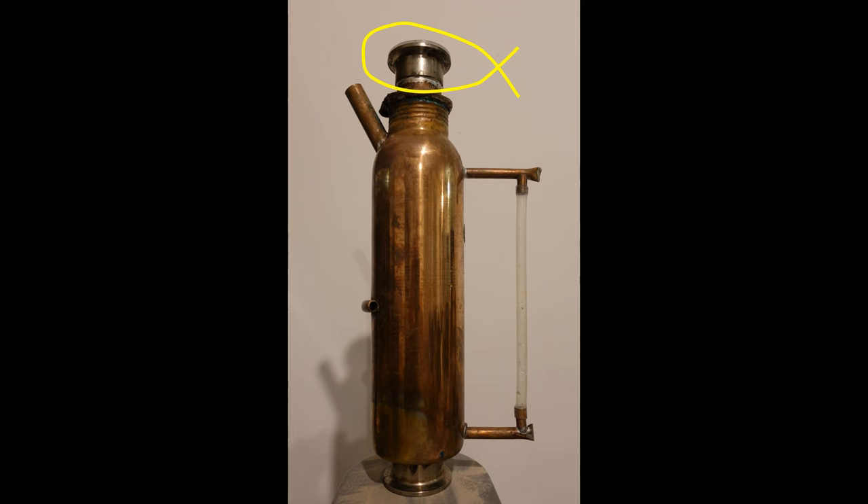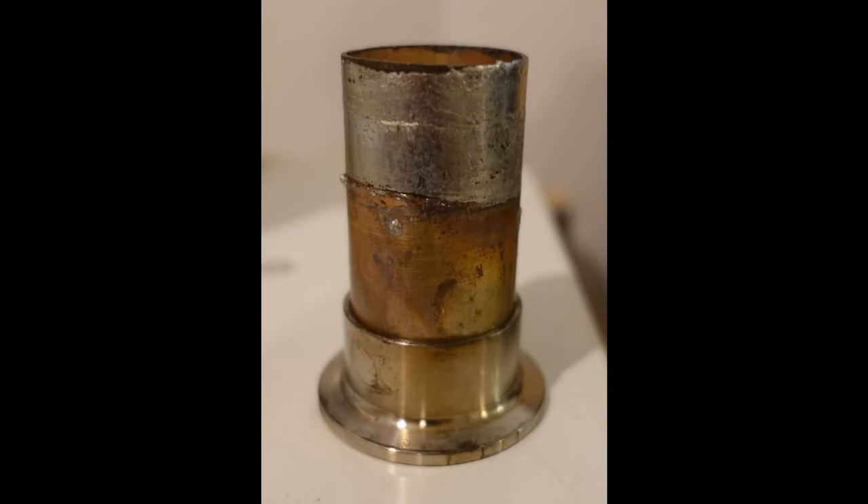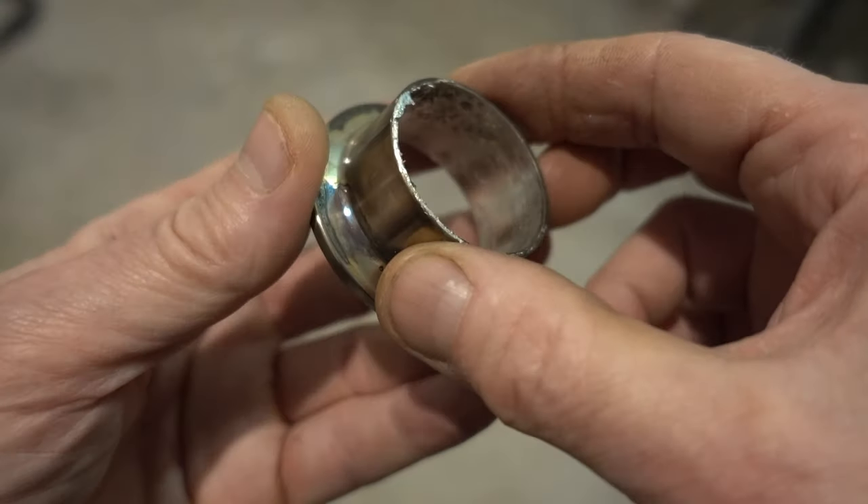When I finally got it to work it was my best joint yet, and it wasn't difficult. I took a piece of copper pipe about 3 inches long, prepared the joint in the usual way, and added the flux. Then I heated the joint from the copper pipe and added the solder. When it had run all the way around the joint I heated the ferrule directly to make sure the joint was all hot. While it was still hot I disassembled it, and while the ferrule was still hot I used a heatproof cloth to wipe the excess liquid solder off the inside. That resulted in the outside of the piece of pipe and the inside of the ferrule being tinned with solder.